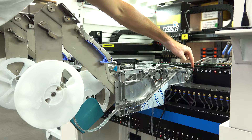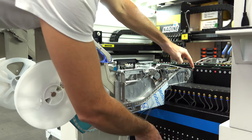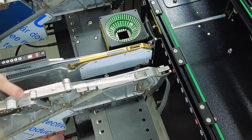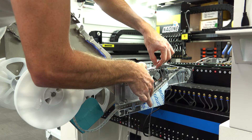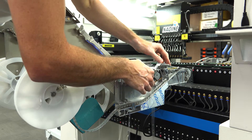I'm in feeder location 21 here, so I'll take the control lead and plug that into position 21. Before I do though, I can see that I didn't remove the twist in the film. So I can relieve the tension on the tape and either twist the film in place or just do that during the tensioning process.